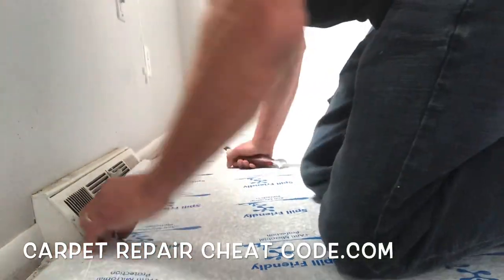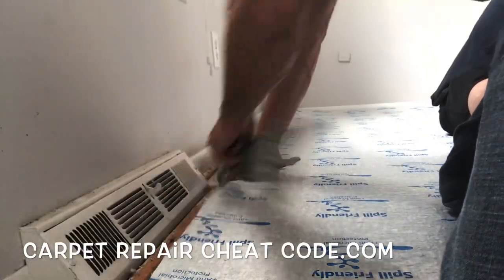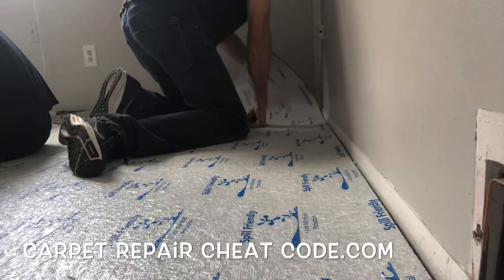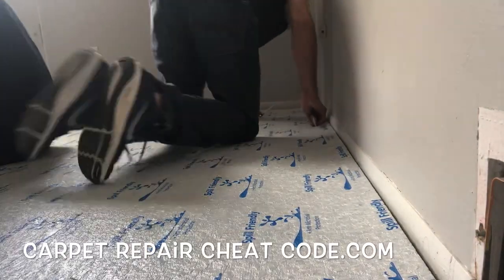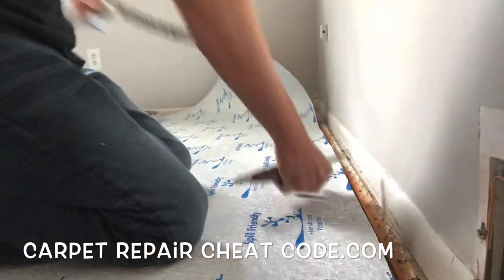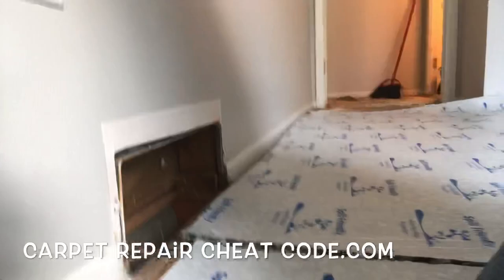If you're doing this over a concrete subfloor, a few things to keep in mind: you can glue it to the concrete subfloor, or just tape the seams together. Once you trim it in, tape the padding to the tack strip — put a little tape right where you cut it to the tack strip to help prevent it from moving as you unroll the carpet. I'll actually do a video on that since it's easier to show than explain. Buckle up for that.